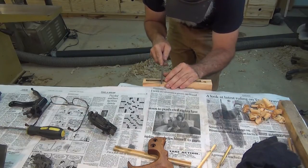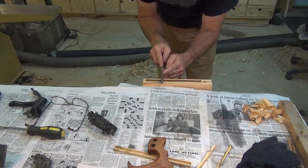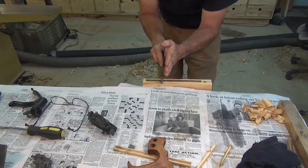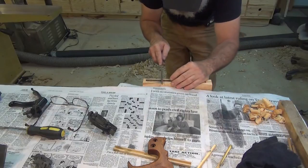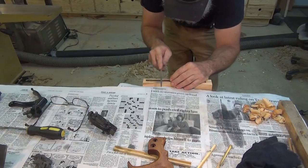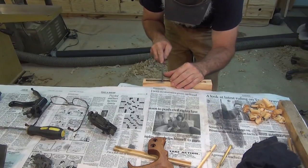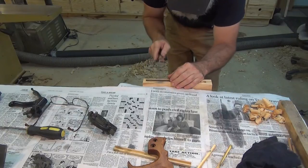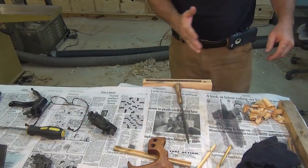Okay, from here on out, I'm going to really roll this saw over until I want this edge of the file to be really vertical. That's going to cause the teeth to have a real, real hard rake to them facing forward. Because this is probably about like watching sanding, I'm going to turn the camera off and come back when I have finished the plate.